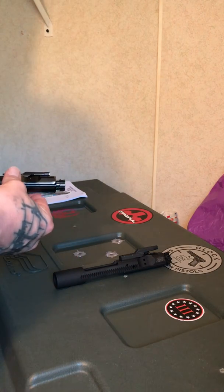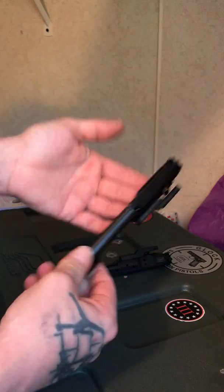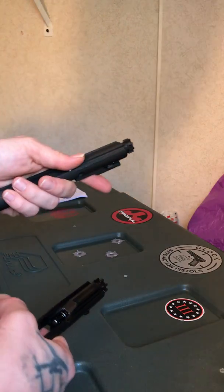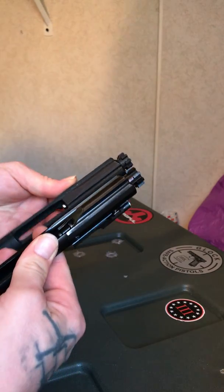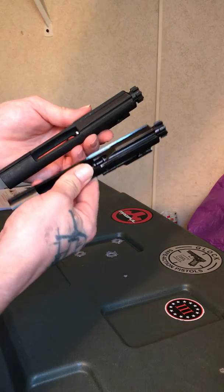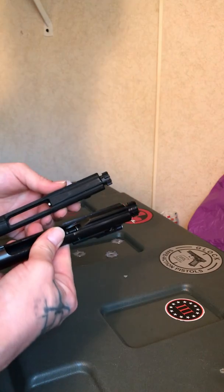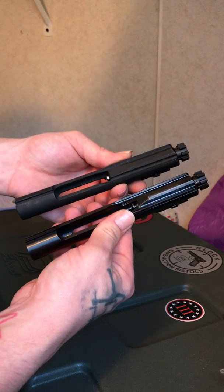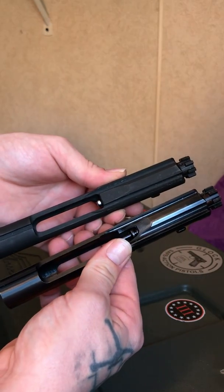If you really want to talk about the big major differences between the AR-15 bolt and the M16 bolt — a lot of people like the M16 bolt better because it slows the rate of fire by a touch. It's so little that a lot of people will not even notice it. But not only that, you can see how it's got more mass here and here, so it weighs a little bit more but not much more. Having this bigger mass also means more balance in your rifle, which in turn makes your rifle operate and function more properly.